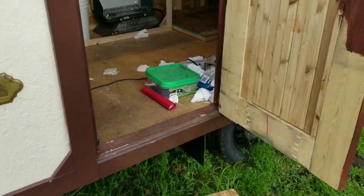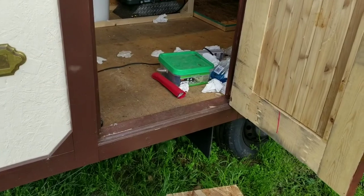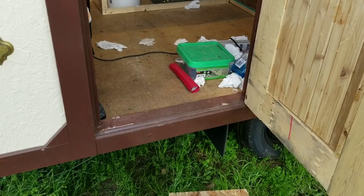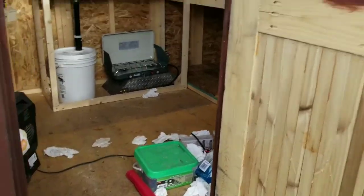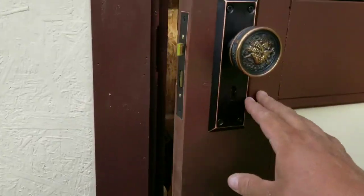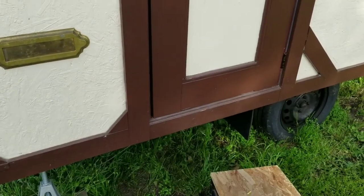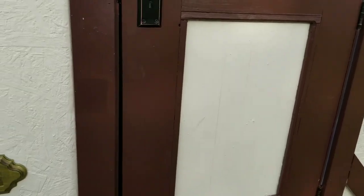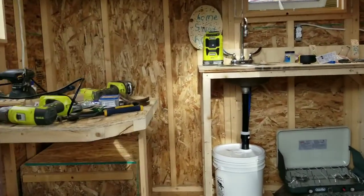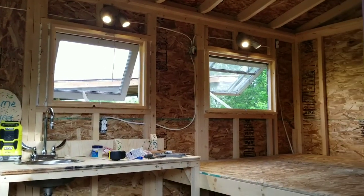There's 8 carriage bolts that go through the sill plates, right through the steel with big washers on them, right? And I didn't think it was going to do much. I tightened them all up and they all took a few turns. But this door used to have a really hard time shutting. Like I figured, oh, I'll fix it later. But now it's like butter. I don't know. The whole structure must have straightened up or pulled down a little, or at any rate, the whole project's a freaking mess right now. But it's coming along now.